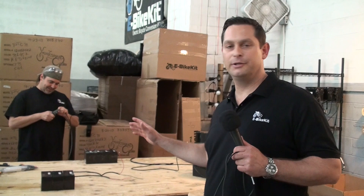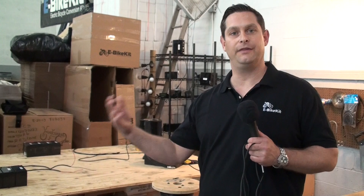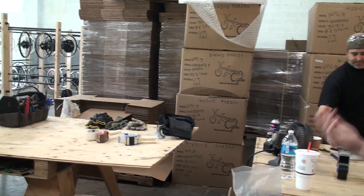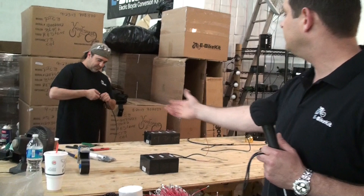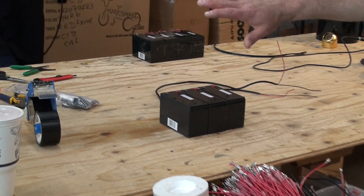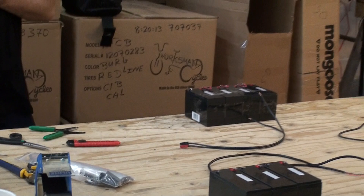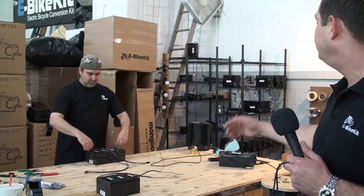Here's where we do our batteries. We do a lot of SLA batteries — they are a lot more popular than you would think. We build all the batteries in-house. We bring in cells locally from a good company in New York; they're all Rhino brand cells. We bring in the cells in different sizes — we have 9 amp-hour and 12 amp-hour, and we build 36-volt and 48-volt packs with those cells. We put the cells together, reinforce them with masking tape underneath, then use the soldering machines here and solder all the wiring in. We give you the proprietary discharge and the XLR charging. We also do a lot of custom stuff based on what customers ask for. Every SLA battery here is professionally soldered and then shrink-wrapped with heavy-duty shrink so they stay in.